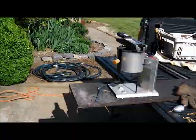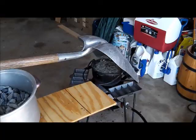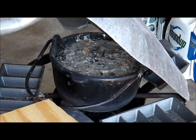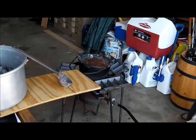I've added lead to this two more times and you can see it's pretty much full now. Once I clean that crap off the top and put some cleaner in there, she'll be ready to go. These are ingots - these little one-pound blocks to sell on eBay. You can do them in muffin and cookie pans but to make them nice and uniform, each one being one pound, I use these little molds. I've got three molds so I can pour 12 pounds at one time. Now put some cleaner in it - it's probably going to flame up and make a little fire.